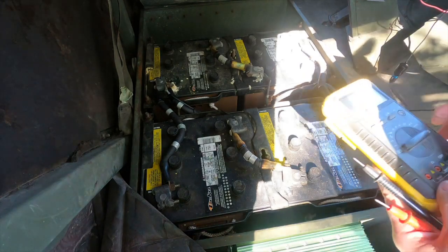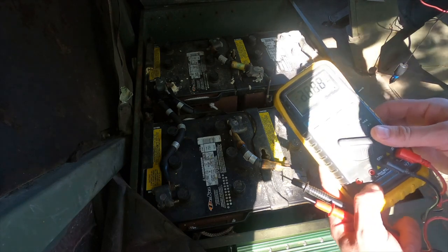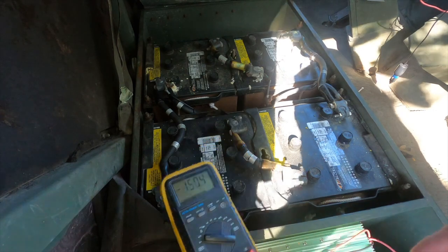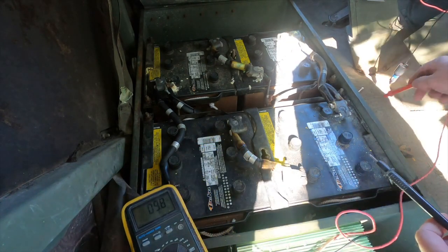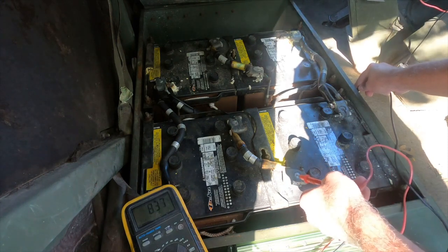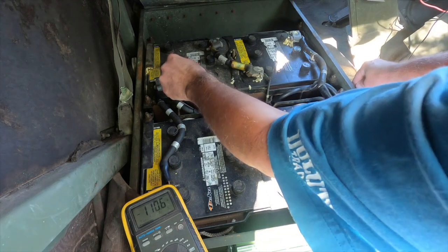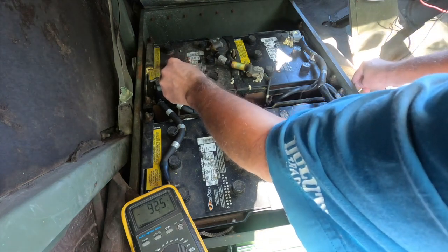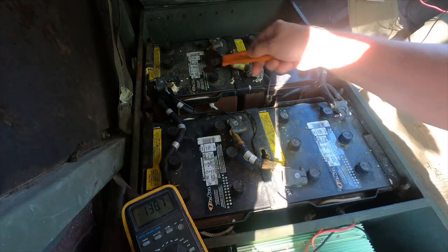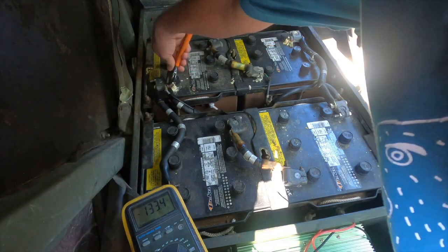With these 24-volt systems you need to know where your ground is, because positive is connected and negative. I brought a meter, set it on DC, and check between your actual ground and your terminals and you'll see you have voltage there. Over here we have it's just in millivolt, so there's no volts — that's the wire we need to disconnect first, and that's going to be the safest point.